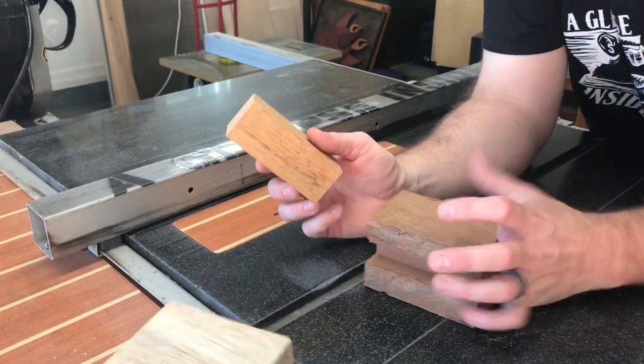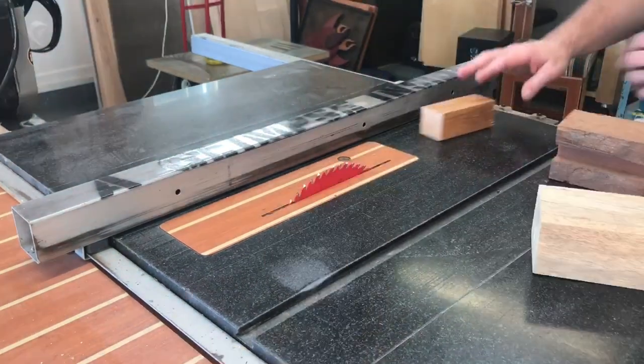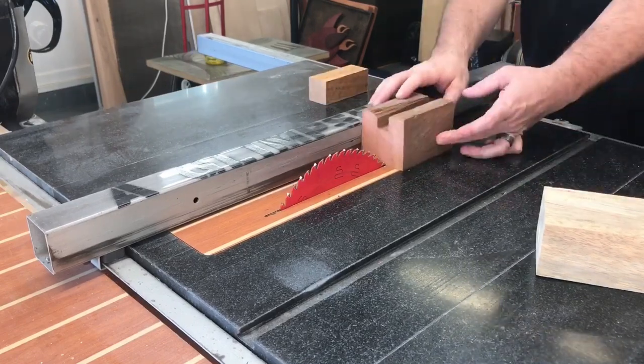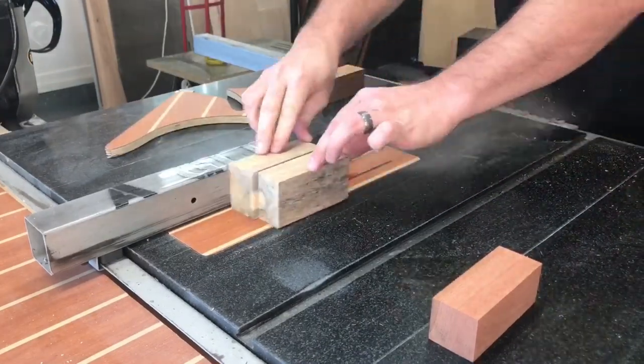Here's my box of wood. I actually like the size of this piece right here, so I'm going to set my table saw up to replicate it. To match the same size, I basically bring the fence up to that piece, up to the saw blade, and you're good to go. Be careful cutting short pieces on the table saw — make sure to use your push stick when necessary.